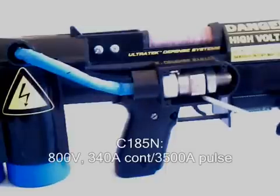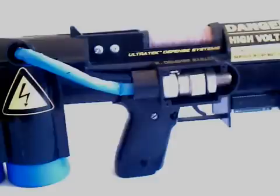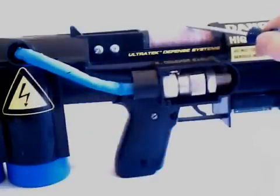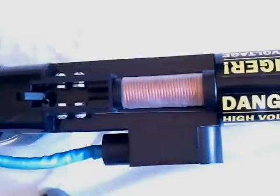The SCR is a large semiconductor, which functions as a switch for the gun. When the small 3-volt signal is applied to its gate, it dumps all of the energy stored up in the capacitors into the coil. When the coil is energized, it generates an intense magnetic field, which launches the projectile through the barrel towards its target.